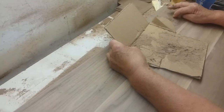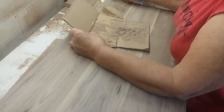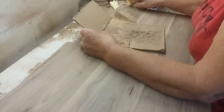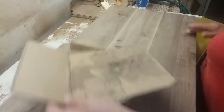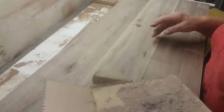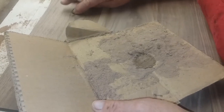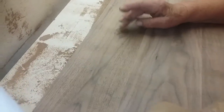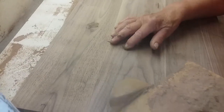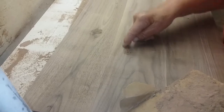The trick to this is you want to use a stainable glue, like Titebond and different things like that — those are stainable. I think Elmer's has some wood glues that are stainable too. Here she's got a little bit of glue in the middle and she's just working the dust into it, making a putty. Then you want to press that in and let it set for about an hour so it can dry out.